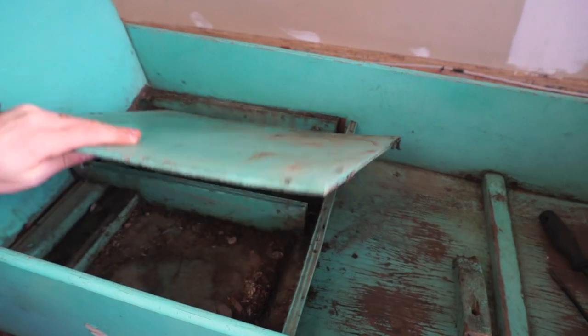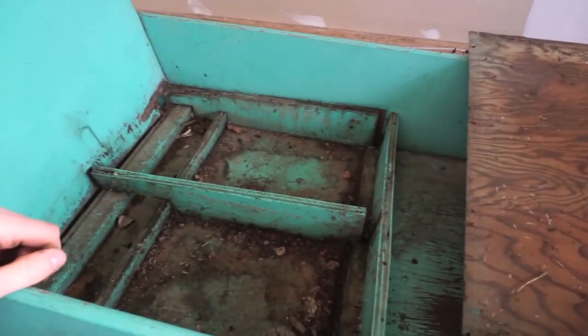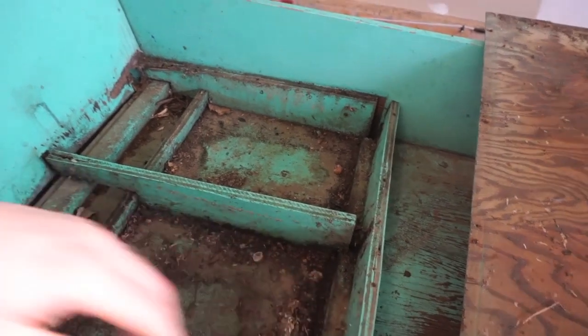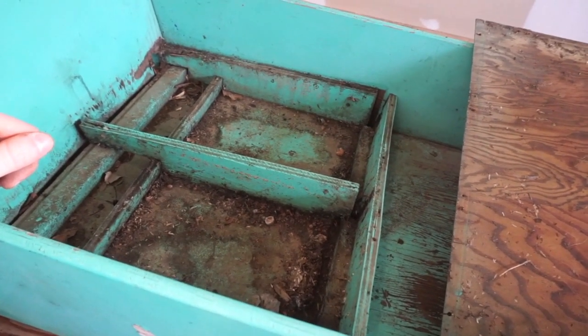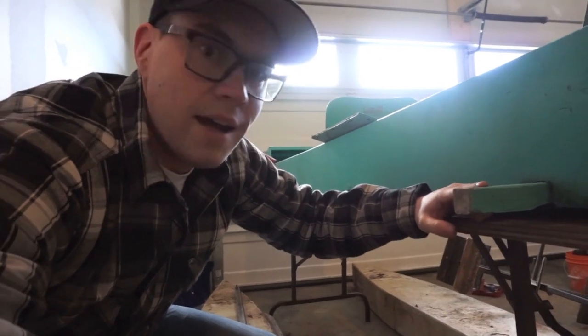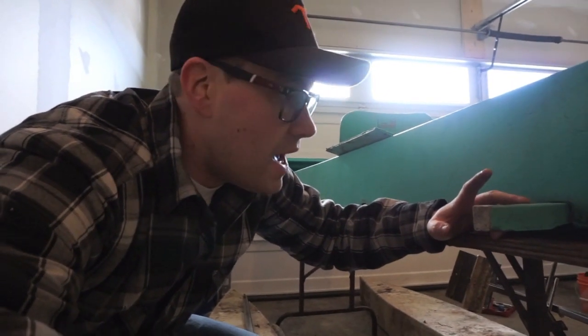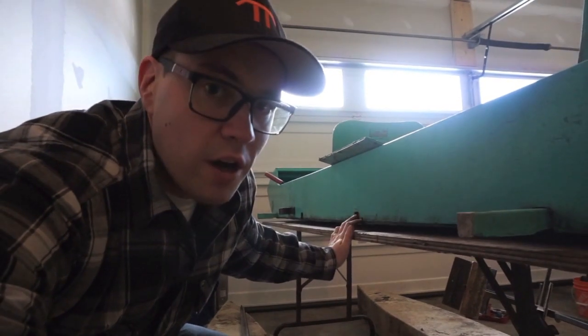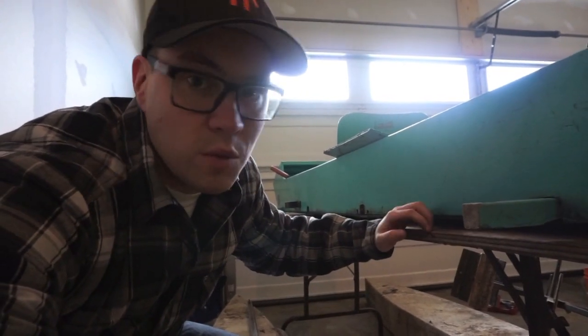Overall this boat's actually in pretty good shape considering its age. There's a couple of rotten spots but it won't be too bad to fix. Looking at the back floor here — this is the back seat — the rudder pushrods sit through here, and underneath it's pretty much completely rotten out, everything's just falling apart. I'll have to rebuild this box seat and figure it out from there. Probably one of the trickier parts is going to be replacing these beams — they stick out from the boat and this is what attaches to the pontoons. A couple of them have rotted off and broken away, so we've got to pull the whole floor out and replace at least two of these, and then see how the other ones are doing.